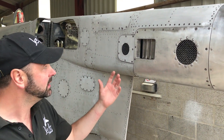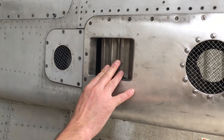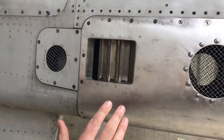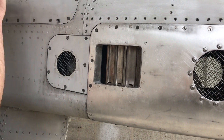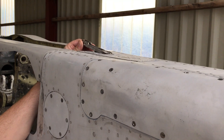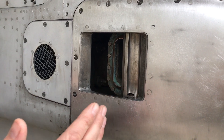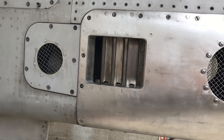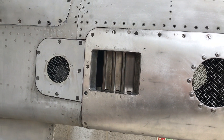This is what's known as a reaction nozzle — it's a small valve that opens and closes. This one on the side controls the aircraft in yaw while it's in the hover. When the pilot moves the rudder with the rudder pedals in the cockpit, the rudder will move left to right, but the reaction nozzle also moves left and right to allow high-pressure bleed air from the engine to blow out of this duct. There's one of these on either side of the tail boom, and when this one opens the one on the other side closes, and vice versa — a very simple but ingenious way of controlling the aircraft while it's in a hover.